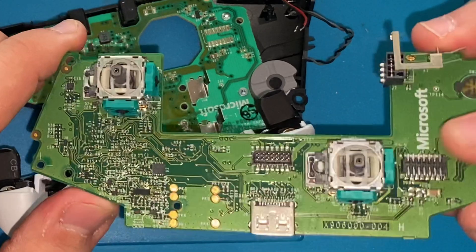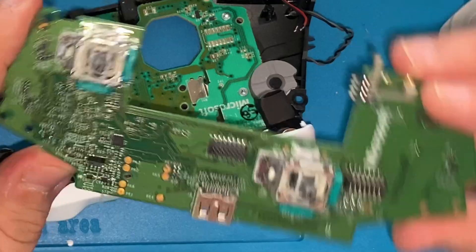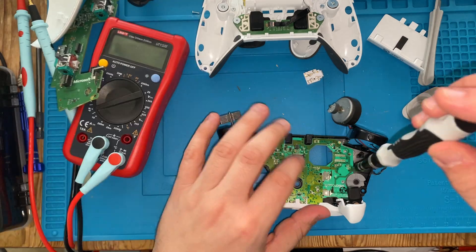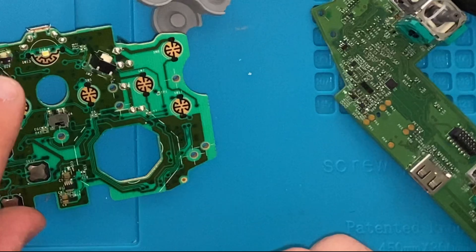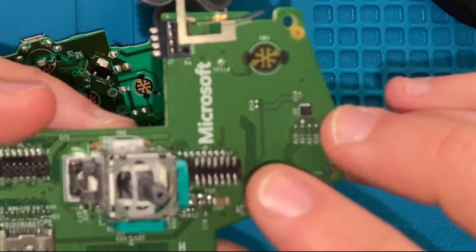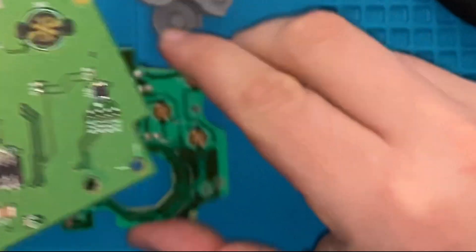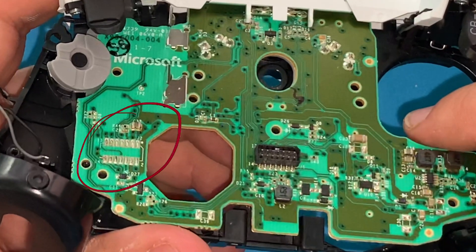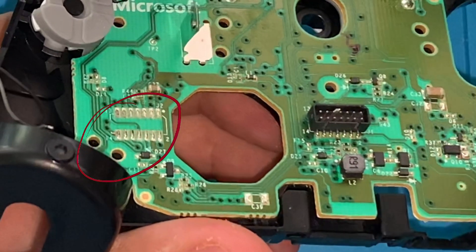Okay, let's see — I see some corrosion here. Alright, let's take out this board. From looking under the microscope I realized something. This looked really odd and I couldn't figure out what was going on, but under the microscope this is actually a plug and it's ripped off on this board. So the first step is going to be to solder this back on and resolve this issue.